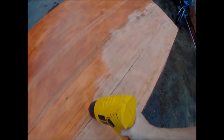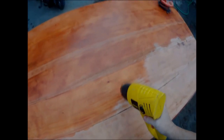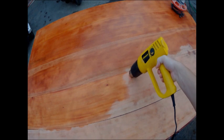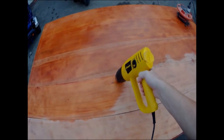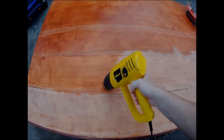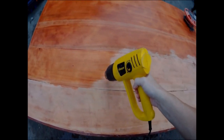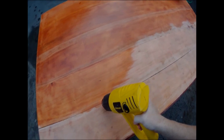Now it's going back to pretty much its normal color. It's going to be dry sanded to get some of those little black marks out of it, then stained the right way. Stay away from varnish and all those plastic finishes — don't use those things, they're a disaster waiting to happen. Because of that varnish I chose to redo the table top entirely — a lot of extra work, but who cares, because in the end the product and how good it's going to look will speak volumes. If you have to redo something, be a man, get the job done.